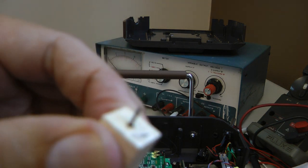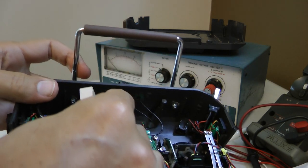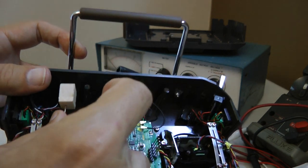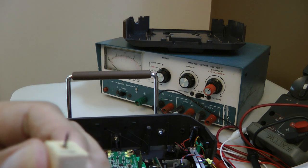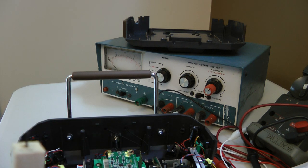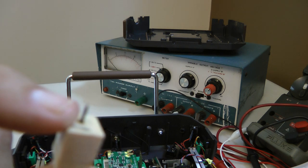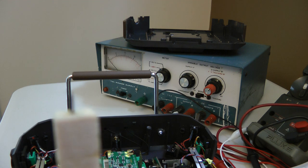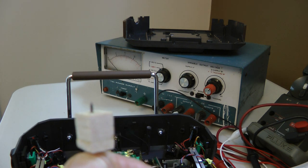and then I used a T-pin. So once I had the block against the plastic where I wanted it, I just pushed the T-pin up and it made a little score mark on the plastic, so I knew where to drill the hole. Then as far as getting the starting hole going, I heated the pin up, made it nice and hot, and then just pushed it through the plastic, and then I took a drill bit from the outside and actually drilled the holes.